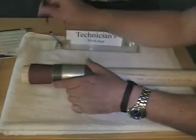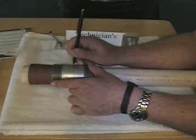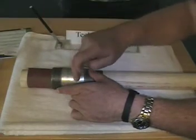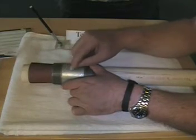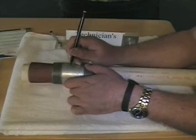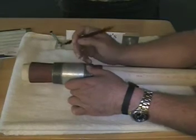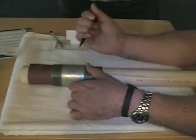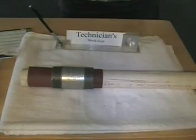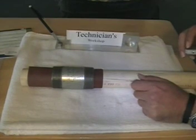That's not too difficult to do either. The ports were laid out and measured — I'm not going to go into that detail for this short video. But when the ports are laid out on the pipe, I just took a hacksaw and cut the horizontal cuts. At the ends where there's a vertical part, you can't get a hacksaw in there, so that was removed by using a drill. You drill a great big hole right there on one end and on the other end, and the piece falls out. It's not that difficult to make big rectangular-shaped ports in a pipe to make the quick dump valve. So that's a short instructional how-to on creating the quick dump valve parts and the valve cylinder nice and smooth for a good seal.